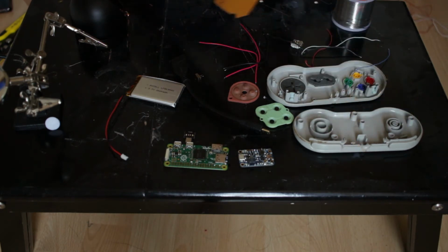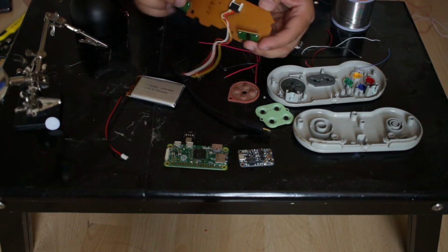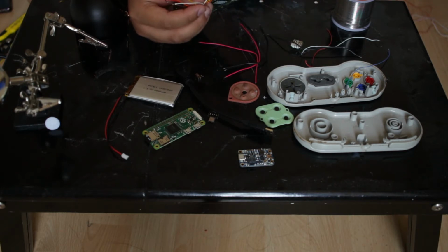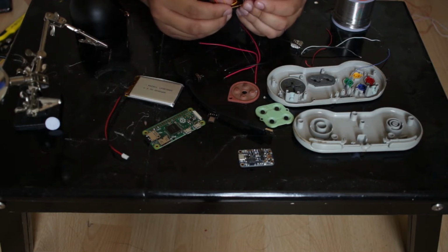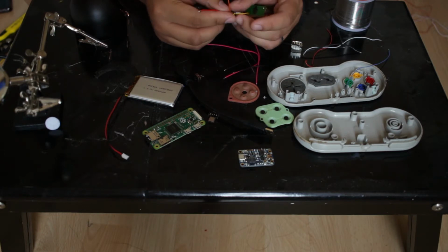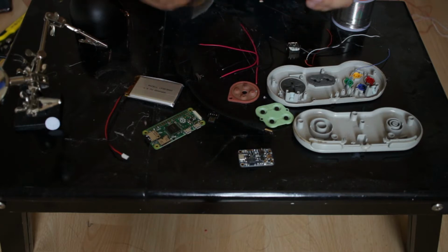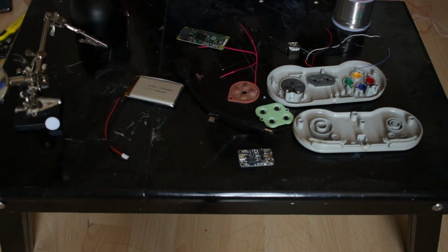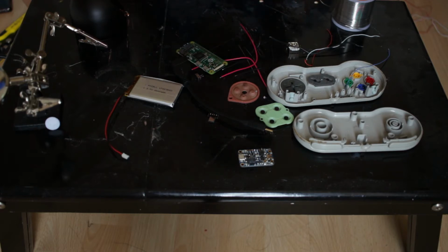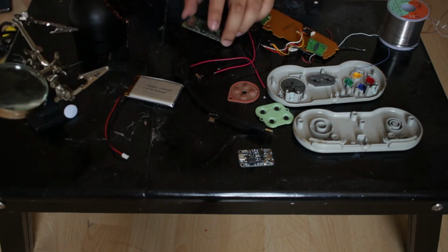So as you can see, you have this board here, and you can use these wires and attach it to the GPIO pins on the Pi. With the SNES controller, the white wire is the VCC, the yellow wire is the clock, orange is latch, red is data, and brown is ground. So yeah, you can wire these up to the Pi and then configure them using a script on RetroPie. I'll explain that as I go on. So anyway, let's crack on with it. I'll leave all diagrams and everything in the link in the description below.